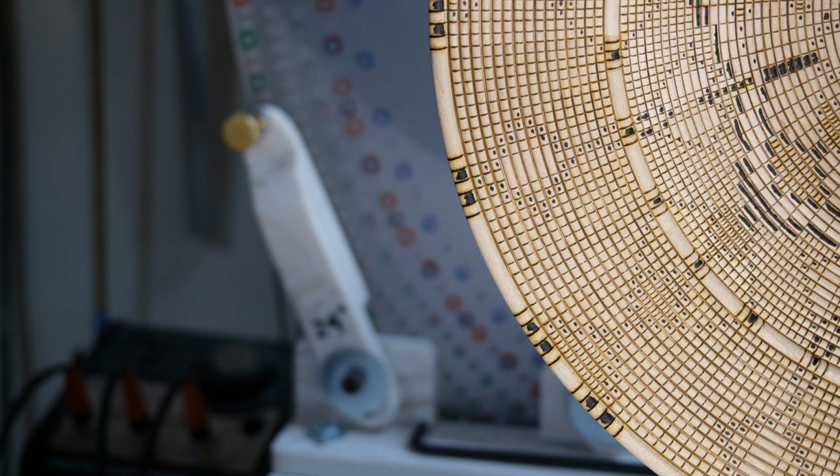And so what that does is, if you have an index wheel, or if you're using a piece of marked paper for your indexing, say your wheel or your paper only has 100 divisions, by phasing it like that, you can double the number of divisions, and you can even go farther than that. It gets a little more complicated if you go past just doubling it, but that's how you can intensify the pattern on a wheel that doesn't have as many divisions.